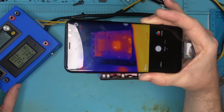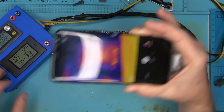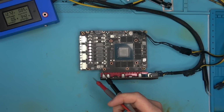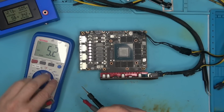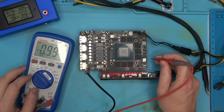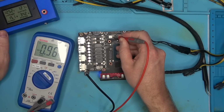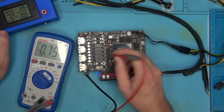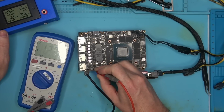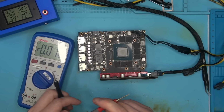Okay, so looks like the core is powered, and so is the memory, and we're pulling 1.2 amps. And well, that's great, but do we have voltages like PEX? What's the voltage on the actual memory? 1.26. Okay, do we have PEX? Yes. And we have core. Okay. 12 here. That's 12. That's 5. And that's 1.8. Okay, good. Everything's looking good.